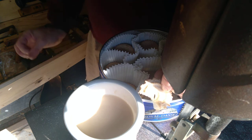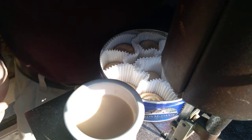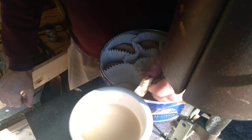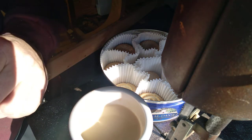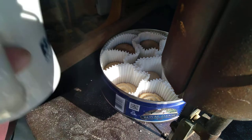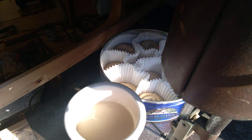And as soon as we've done that, we'll be able to batten fair the edges and cut the final shape of those garboard planks. Like I was mentioning before, there's a bit of a kick to the plank at the transom, so that's why these scarfs are going together with the boards at a slight angle rather than lining up the straight edge on the plank. But once we've got that edge spiled on the boat, then we'll be able to cut it, plane them down to final thickness, and then nail them on.